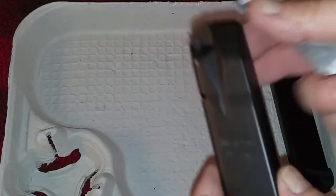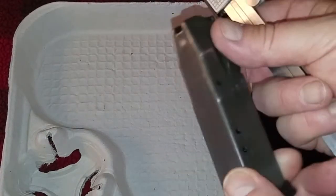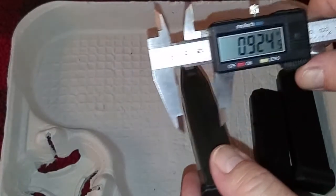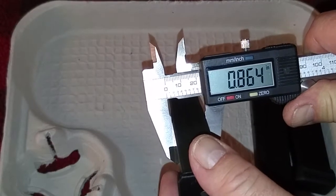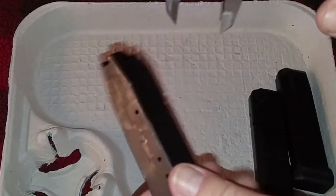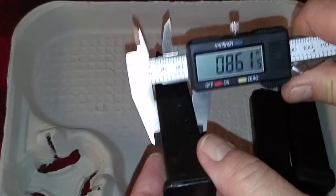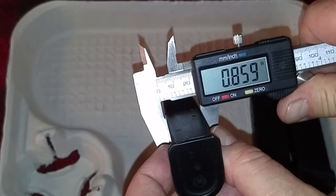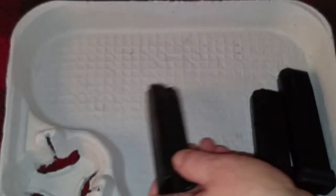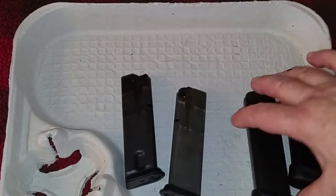So we're looking at a difference: 0.813 versus 0.862 inches — obviously the thicker one is the 357 Sig. Now let's say we have no clue what these are. A quick measurement gives 0.864 — we know that's for the 40/357. The other one gives 0.859 to 0.860, so we know three are for the 40/357 and one is for the nine millimeter.